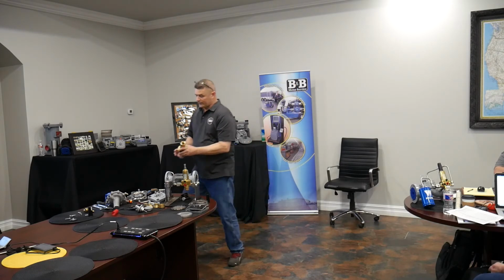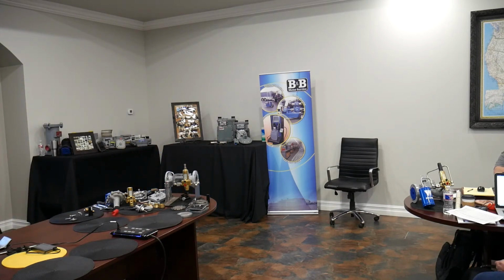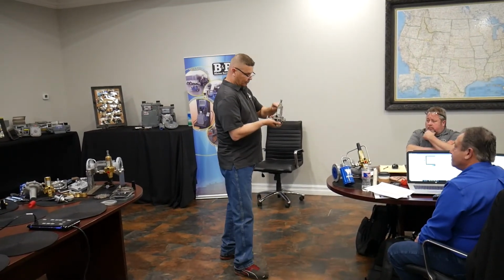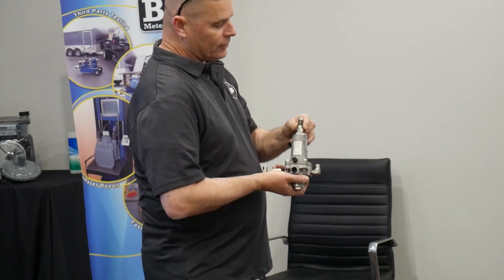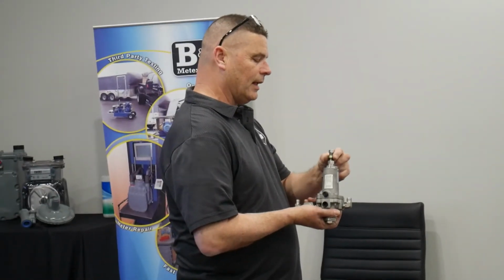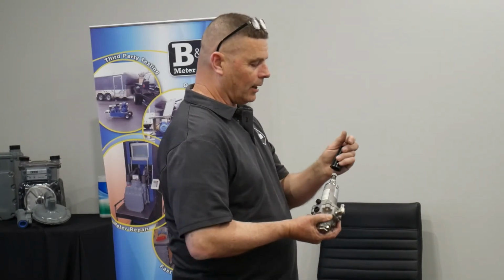Okay. The one other thing that'll come with it too, and it isn't on this stem, but the adjusting screw stem on those real heavy springs has to have a way to make sure that I can't compress the stem and break the spring. If I didn't have this here and I ran it all the way down on the green spring, it's so stiff it might actually snap. So these are to prevent that, they can still get the full value of the spring, but it'll prevent it from snapping. So this is basically something that they can install. You just push a little roll pin out, take the nut off, either put her on or off, depending on whether they need it.